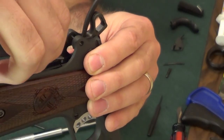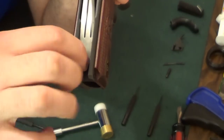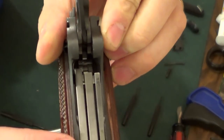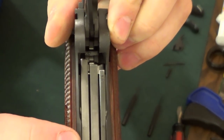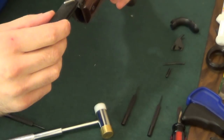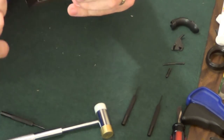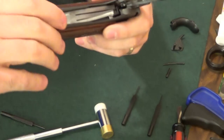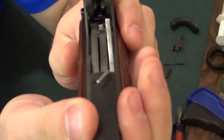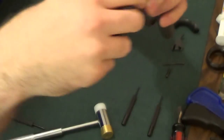For mine, I got to go in top first, then set it down. The bottom will hit that little groove, hole there. Spring should rest looking like that. Alright? Now what you need to do next is take your main spring housing and get that started in there. Make sure your grooves are nice and clear there or that can get jammed up on you. You don't want little pieces of anything up in there. There we go. You don't do it all the way, just enough to get it started, because as I get it started, it pushes the spring down. That will come in handy later.